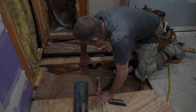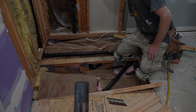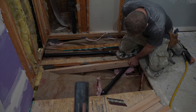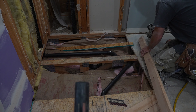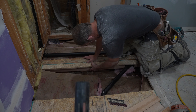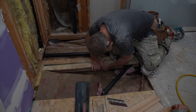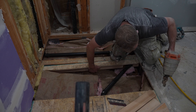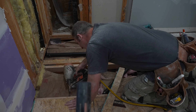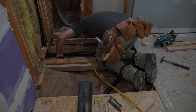The first thing we need to do — as you can see here — we have some truss joists, 24 inches on center. So the first thing we're going to do is use some two-by-fours and recess this below the truss area. We've got some plumbing in the way here, so we need to make some adjustment cuts. We've got some three-quarter inch OSB, and we're going to use this as a reference to the top of our joist. We just basically use this plywood as a template or gauge for how far down this joist needs to be. We're going to use some 16-penny nails — if you don't have a nail gun, you can always use screws; I'd recommend three-inch deck screws. It's just a matter of recessing those two-by-fours below the surface so that you can put plywood even with those truss joists.